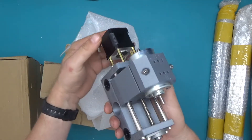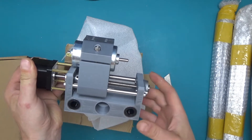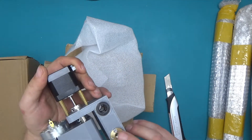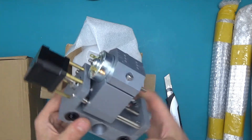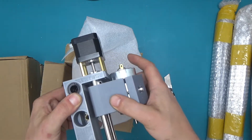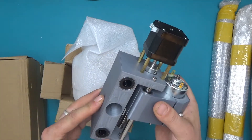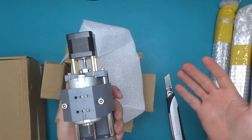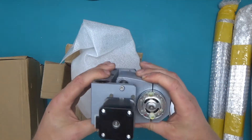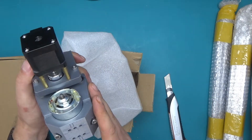So this is the entire Z-axis. We've got linear ball bearings and an anti-backlash screw. This whole thing is 3D printed and you can clearly tell by the pattern it left, and that's okay. There is an option to get a metal Z-axis, but for the purpose of drilling PCBs this is absolutely adequate — forces on there are not going to be that great, this should do just fine.